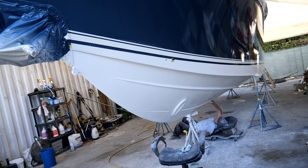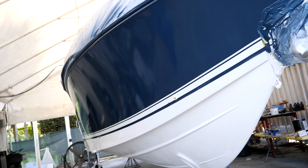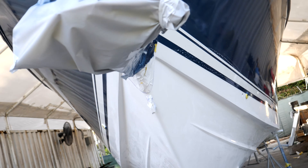What we did is we media blasted the entire bottom of this boat. We got rid of all the layers of bottom paint, got rid of the epoxy layers, and went down to the factory gel coat. Wherever there were blemishes, we went ahead and fixed those.